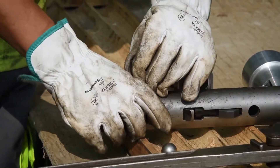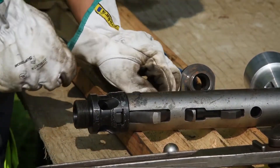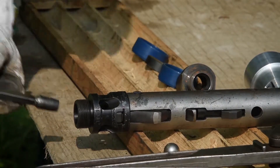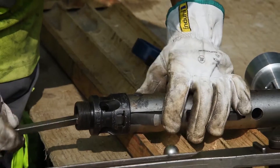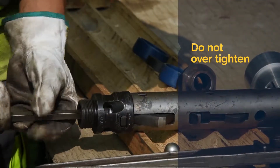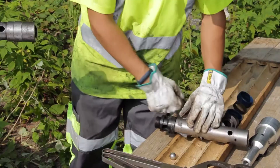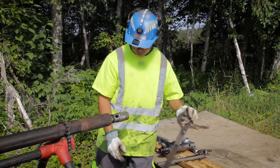Insert the landing indicator ball. Insert the lower assembly rod into the latch body assembly. Insert the assembly bolt and two-piece lock washer into the latch body assembly. Tighten the assembly bolt into place, being careful not to over-torque it. The lower assembly rod acts as a latch lock to ensure the latches stay engaged with the locking coupling.